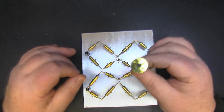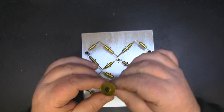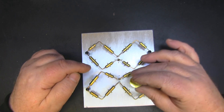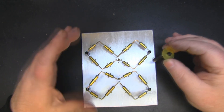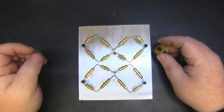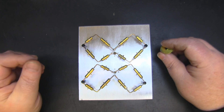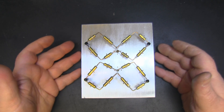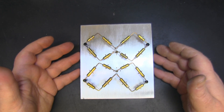When we're talking about parasitic elements, we're talking about something like you'd have on a Yagi — I've made antennas with these before. They change the frequency slightly and add a little more gain, and also focus the beam width. Because of this panel layout, you could have one in the middle catering for both antennas, or four positioned in the middle of each quad section, and also on the outside to adjust beam width. There's a lot of potential for upgrades, but it'll be a while. If you enjoyed the video, please give it a thumbs up and drop any comments or questions below.